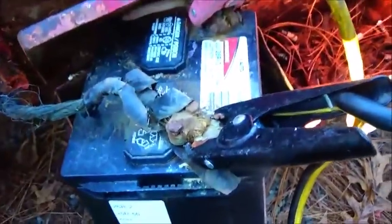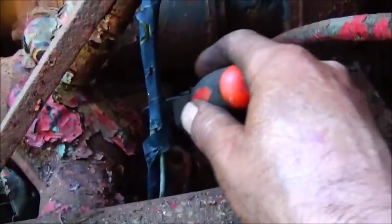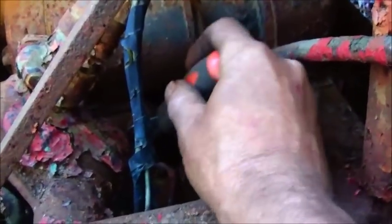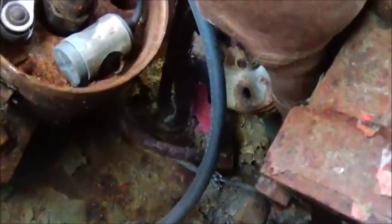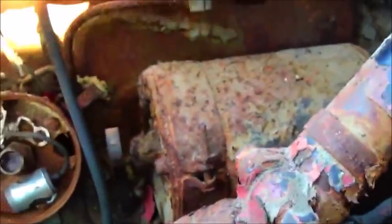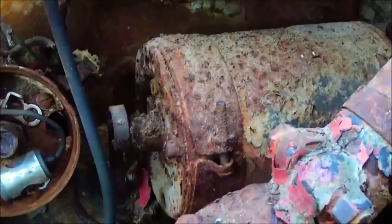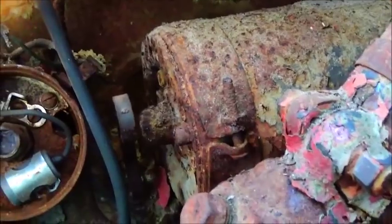Okay, so I just got this battery thrown up here temporarily, and this is the one that was in the four-wheel drive. It's 540 cold cranking amps, so it's a lawnmower battery anyway in my book. But anyway, the solenoid's no good. Trying to cross it, I'm getting nothing, but I do have power down here. So what we're going to do is short between here and the positive down underneath. You can see it, but it's down underneath the starter, and it's actually the power going into the starter. So we're just going to bypass the solenoid altogether, maybe without throwing a bunch of sparks.